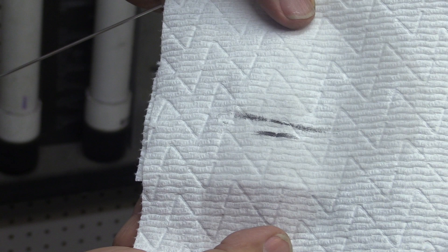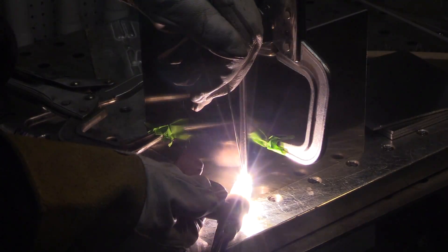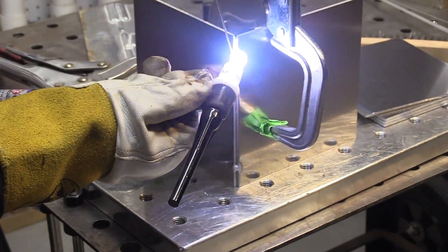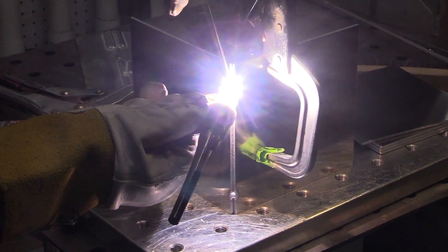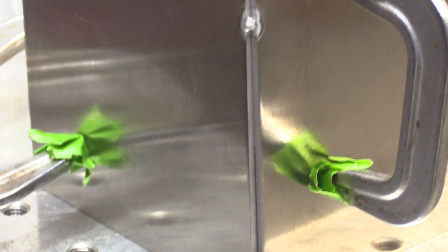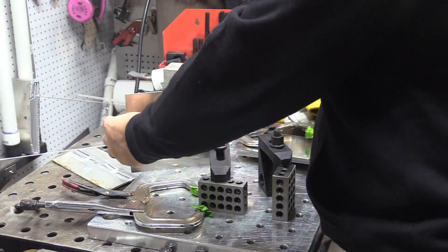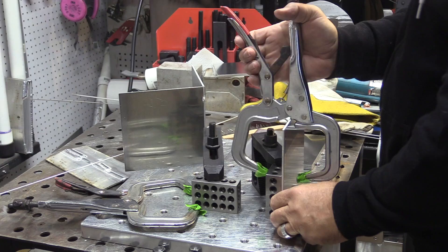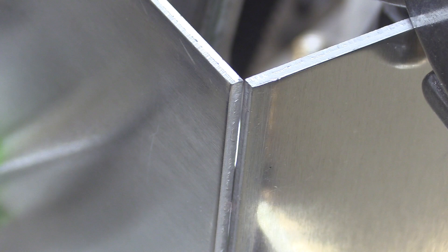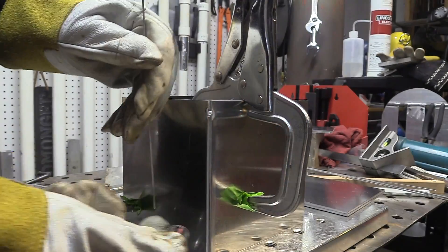I started off using a tapered electrode for the tack welds. That gives you a better arc start for low amperage arc starts on aluminum, and it'll round a little bit more as I go. As I get up to welding amperage — which is going to be around 130 to 140 — I'll set the machine to 140 and I'll just use the foot pedal.